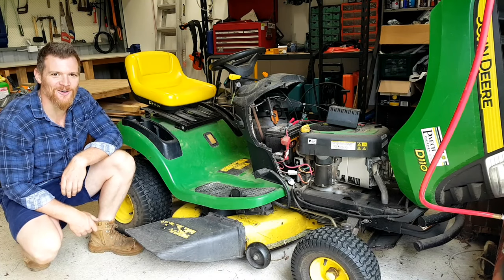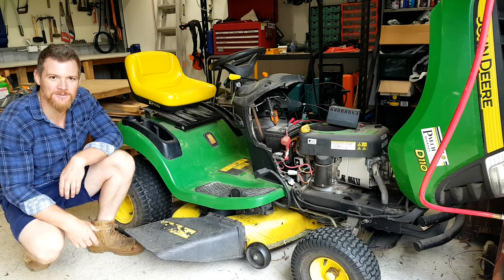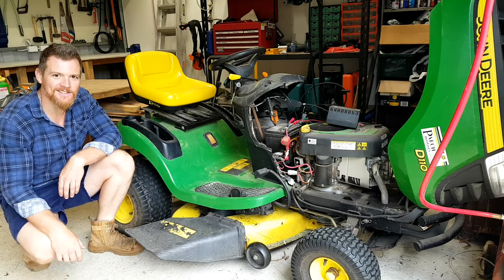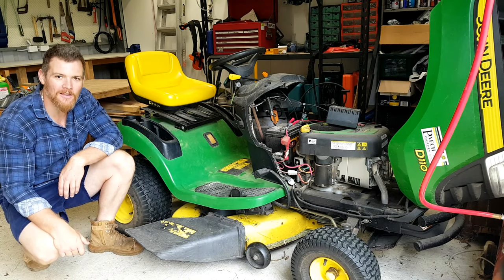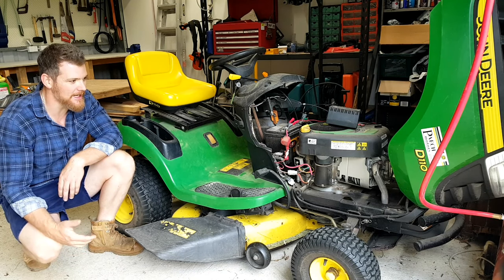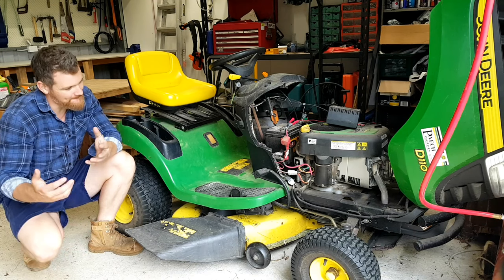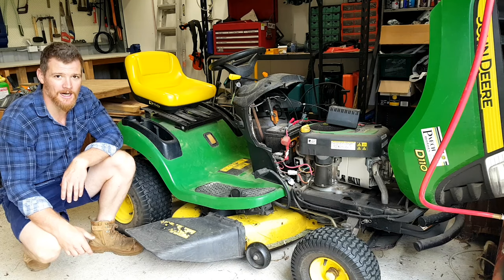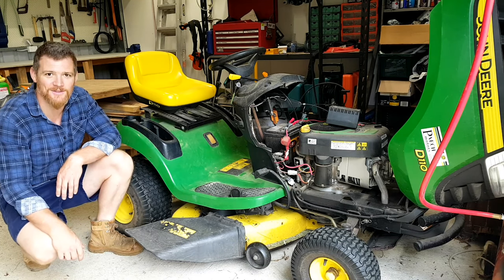Here she is — the limousine on the lawn, baby. I've got her on charge at the moment because I don't break it out that often. If you keep your batteries fresh with a charger on them, that way you've always got a charge in it and it helps maintain the battery life. If you don't, it'll be flat when you come to use it, or your battery will be cactus in a few years. So make sure you always keep it on charge if you can.